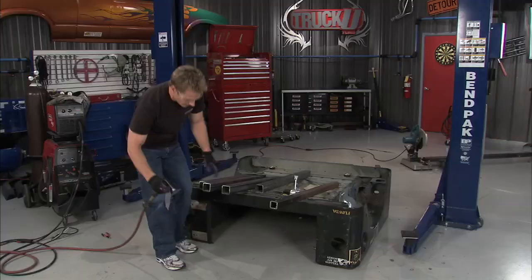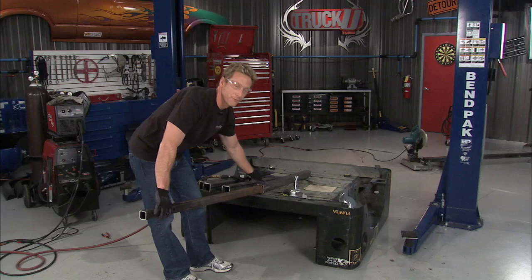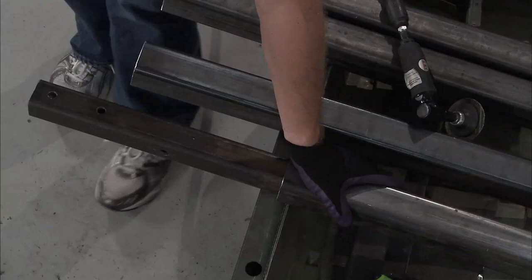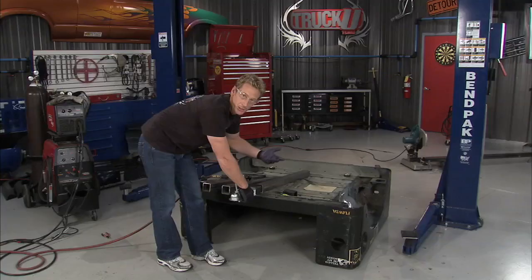Matt went ahead and cut our frame rails. What I'm doing is deburring it all so no one cuts themselves and also so everything lines up nice and square. One thing I want to show you — we're going to put a little adjustment in the tongue. This is going to be our tongue; it'll slide through a piece of the same size tubing and go all the way from the front to the back. We're going to give it an adjustment to make it a little more user-friendly. Our coupler will go on the end — this way is our towing setting. We take the pin out, we can slide it farther back all the way inside, and that way it'll store away and won't take up so much room. Then I can start tack welding the frame into place.